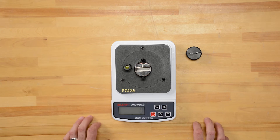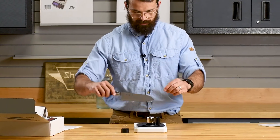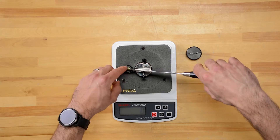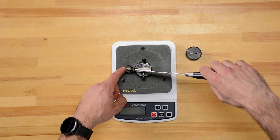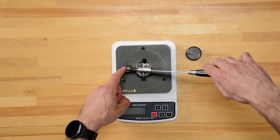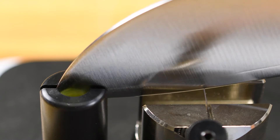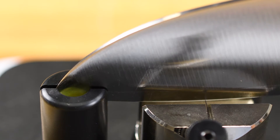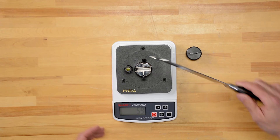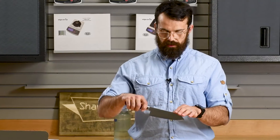When we test the knife, we want to make sure we put the tip of the knife in the knife fulcrum holder. There's a nice rubber gel at the bottom to protect your knife edge. Then we want to keep the knife as close to vertical as possible and slowly lower our knife onto the test media. There we are — we cut it at 59 grams.